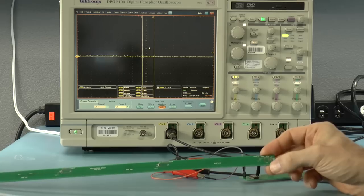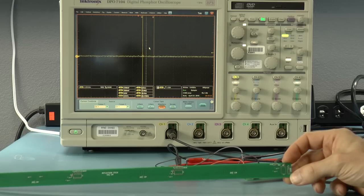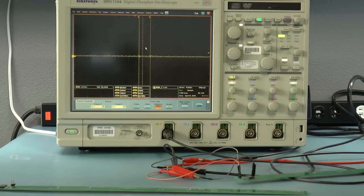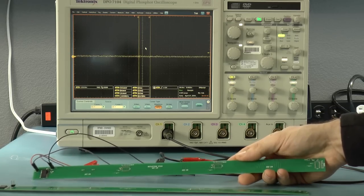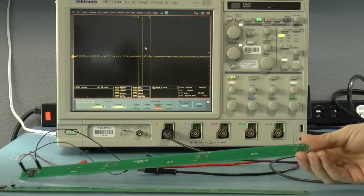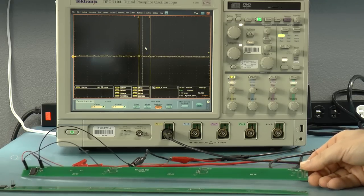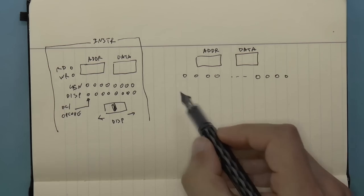I could put a clock here and just let it go and see if I can find double clocks or inconsistent clocks or weird things that happen, but I don't think I'm going to do that for this video — maybe at some point I'll actually do that experiment. What I really wanted to show was the voltage waveforms and what a properly terminated transmission line can do, because when I'm making my RISC-V processor that has 32 registers all lined up on a bus, it's going to be something like this long — maybe a little shorter, maybe a little longer. But at least now I know how to properly terminate that bus. Anyway, thanks for watching.